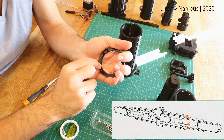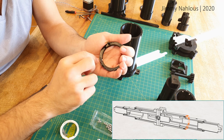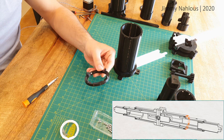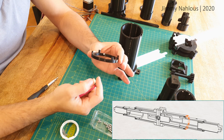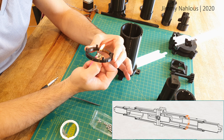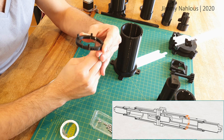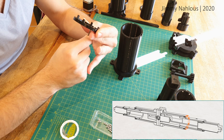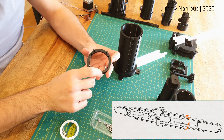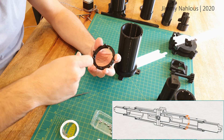Same deal — this is the larger cap. I'm just showing you that the first two ball bearings sit fine but the last two actually fall out. Easy fix for this is the magic lighter. You just heat up the plastic, warm it up a tiny bit, and use a screwdriver or, in this case, the file, and just encapsulate it a bit with the malleable plastic. This will ensure that the ball bearing is not going to go anywhere even if you hold it upside down. Although only two of the ball bearings fell out, I decided to do it for all four — that way when I'm installing this and placing it upside down, no ball bearings fall out.